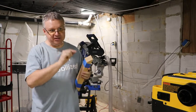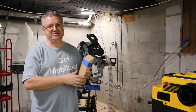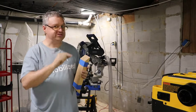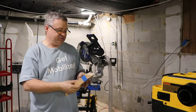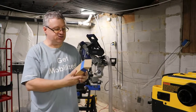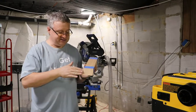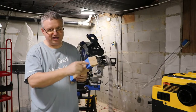Basically the opening is nine by nine, and the frame going in is ten by ten. So basically half an inch all the way around — I was going for a quarter inch all the way around and accidentally doubled it. But for what she was planning on doing, it will still work. So now I am going to go ahead and get these squared up. It was kind of a rough cut, but these are now all the exact same size. So now I am just going to make one chop on these and get them all lined to the same size.